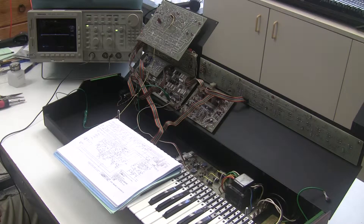I'm going to take this board out and try to find out where the plus 15 is going, and why it's not making it to that op amp for the LFO to work for this effect. I'll pull the board out and get back to you shortly.